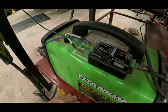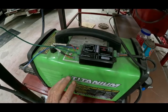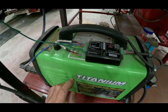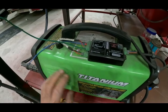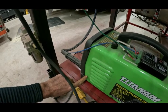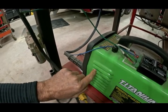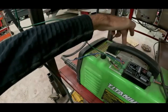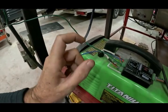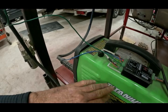It's hard to find the information online, especially with all the different plasma cutters out there. I found a reference — I think it was a Hypertherm — that said it was really similar to the Titanium as far as wiring. Essentially, I found two wires that came off the plug that were the raw arc voltage. They came off the center pin and one ran over to the earth clamp; they came together in some sheathing and ran up to the main circuit board on this side. All I did was unplug it to give myself some room and T-tapped into it right there. It really is as simple as that.